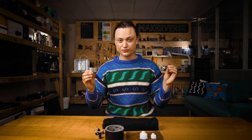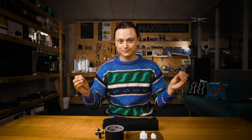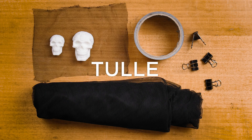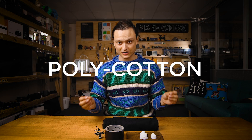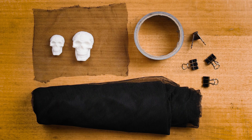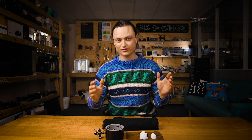Crucially, you're going to need a temperature resistant, stiff and thin fabric and you're going to want enough of it so it can fit across the whole of your print platform. Tulle is the fabric I've been using, which is often used to make wedding veils. Polycotton also gives great results. You're also going to want bulldog clips so that way you can clip the fabric to the print platform. If these bulldog clips don't fit, in that case you can use masking tape. You're also going to need a 3D printer like that Ultimaker 3 in the background, which is the one I've been using to make a number of these fabric 3D prints.